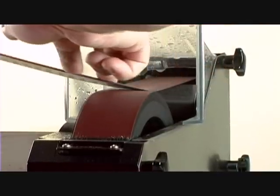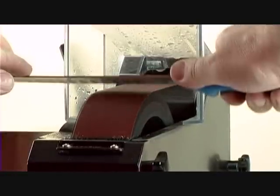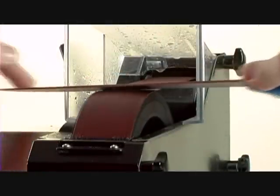Depending on the type of knife, the grinding angle between the cutting edge and the grinding tool will be around 20 degrees. Here the grinding angle was too obtuse, and this also means that the cutting edge will become blunted far too quickly. Here again the cutting edge was ground too thin. With a hollow ground blade like this, the cutting edge will break under the slightest pressure.